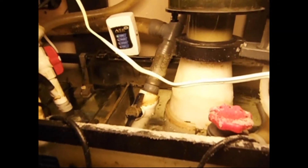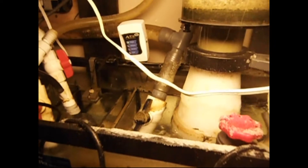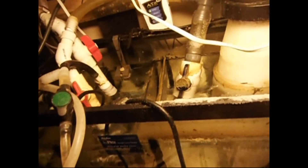In a regular situation, the water is draining and the pumps are running. In my case I have two pumps, though you don't need two — you can do just one. One goes to each return; you can easily do this with just one pump. The idea with the pump is to have it be able to pump as much water as you can given the speed of your drain. So if you have an overflow drain that can handle 600 gallons per hour, you want a pump that can return around that.